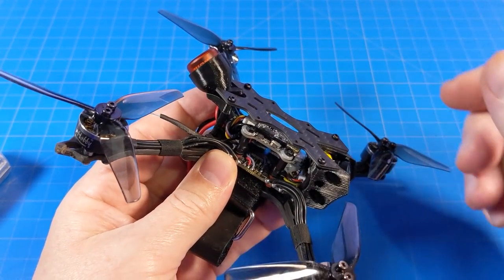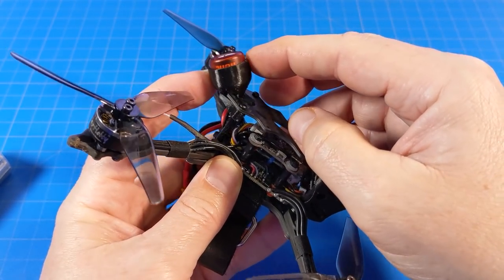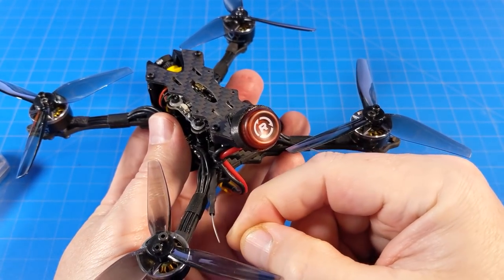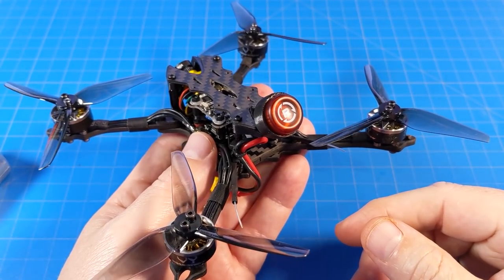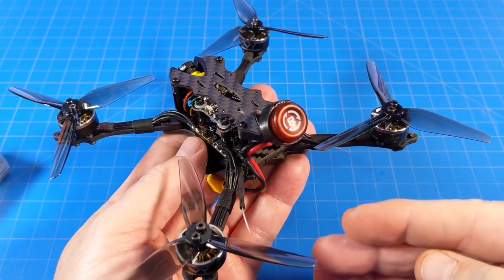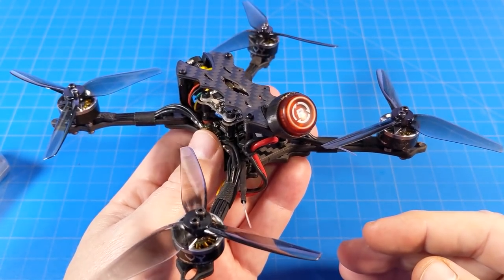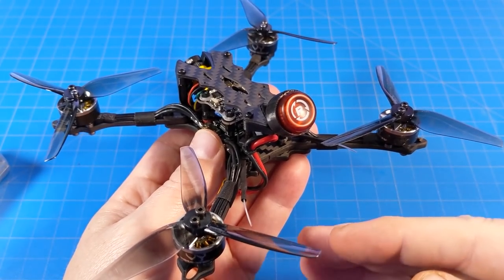The worst part about this antenna print is that it tends to go down with relative ease — a little tiny bump and it tips down. You can feel it kind of pop because of that V-design. But it stays there just fine. This is my mounting, not theirs — I have more antenna end sticking out. They tend to stick it out just a couple of millimeters. For maximum range, you'd want an L-orientation with one antenna up and one back, but for true long range I'd suggest ExpressLRS, Crossfire, Ghost, or Tracer rather than XM+, which is good for a couple of football fields.